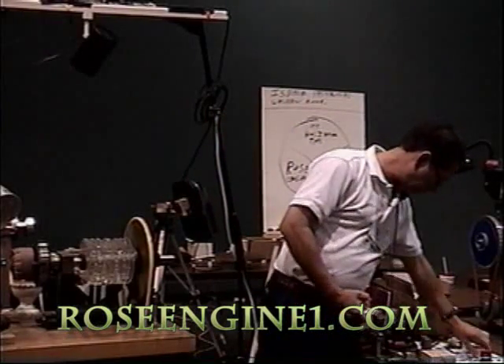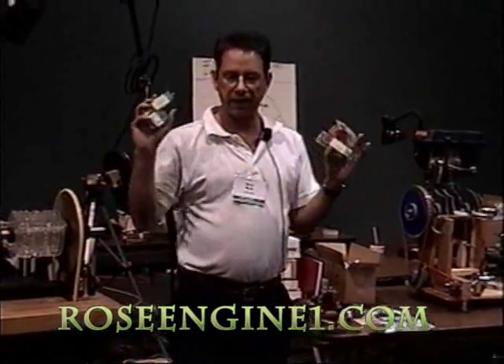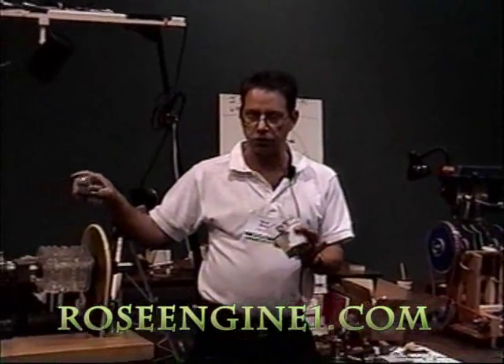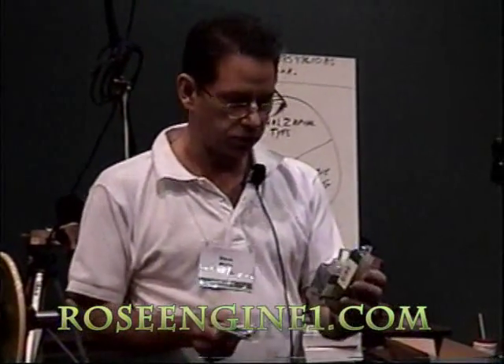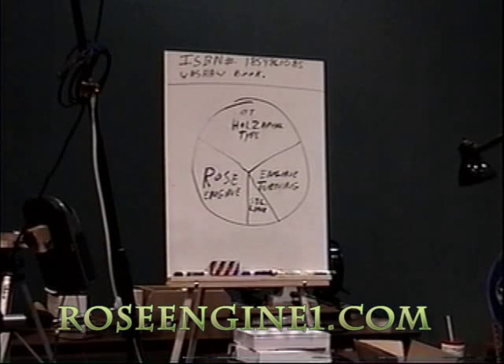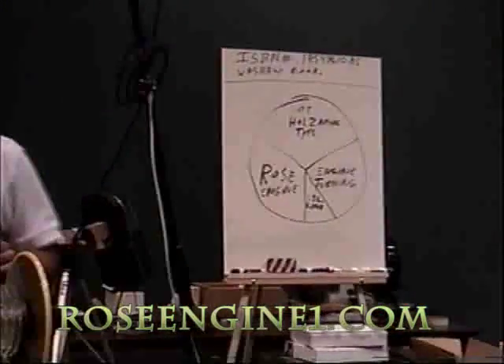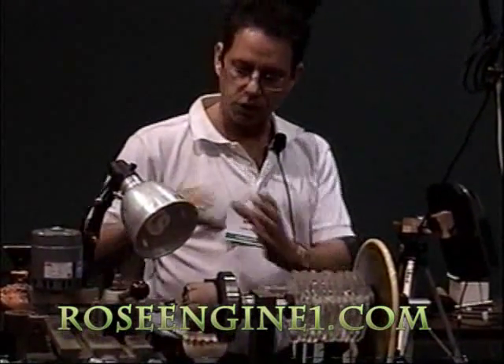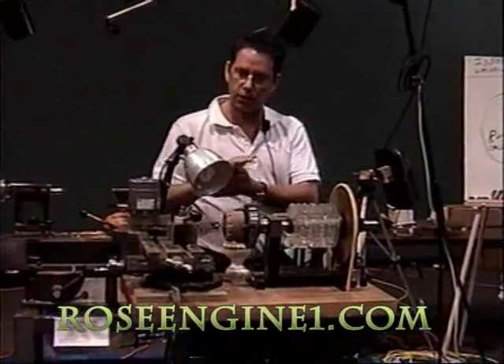Something else you want to consider — I'm going to pass these four around plus his little rotaries. These are router bits that I found to be really interesting on Rose engine work. There's at least five or six in here; they're in their original boxes. Don't overlook router bits — you can make it fairly inexpensive. Just keep in mind, if it's as big around as your router, it's not going to fit on here unless your table is lower. You're going to need half the diameter between here and your base. A flush trim router might work.